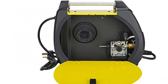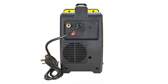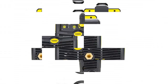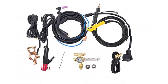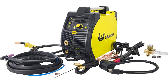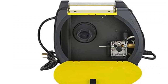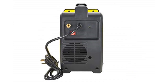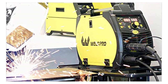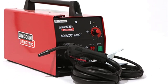I found the dual voltage options to be another boon. Even in a home 110V setting I got the machine running, but the low voltage forces it to hold back considerably, so 220V is the choice for heavy-duty welding. I admit I'm a fanboy of the Weld Pro 200. My mind was racing to understand how a mere 30-pound welder could boast three welding options. I should be forthright though: the TIG welding is nothing more than a toy — it's that bad. But as a beginner, having three different welding options at such an unbelievable price point let me experiment freely.